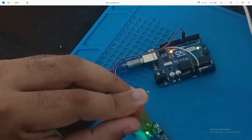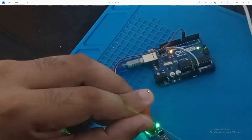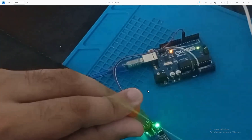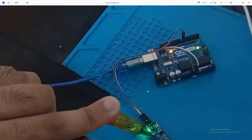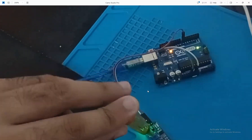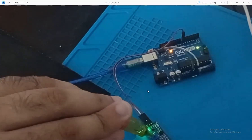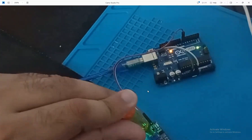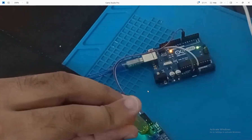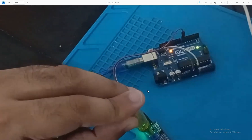The more I rotate it to the left, the sensitivity increases. Now it is detecting every sound. I will lower it down — it depends on the room or the place where you are; you rotate the potentiometer to adjust the sensitivity. In the opposite direction, at minimum, it is not listening at all. Rotating back a little and it starts listening again.